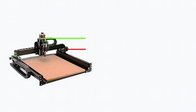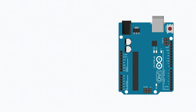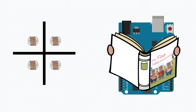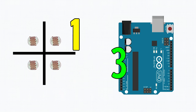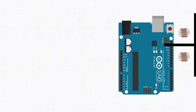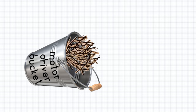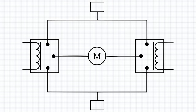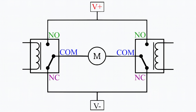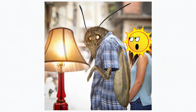The CNC machine is just going to be controlled by my CNC controller that I made in a previous video. For the solar tracker, it will be controlled by an Arduino Uno. The Arduino will take readings from our four photoresistors and create an average of the top, left, bottom, and right side of our X-block. If one side is greater than its opposing side, then it will move in that direction. In order to choose the direction on our motor, I didn't have any motor drivers, so I made an H-bridge using relays. The motor is hooked up to the common of two relays with the normally-closed contact attached to ground and the normally-open to our voltage. To change direction, we just change which relay is flicked on. With that on both motors plus our photoresistors, we can have this thing constantly tracking the sun.